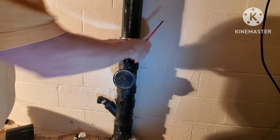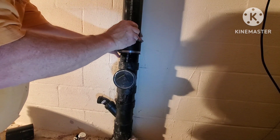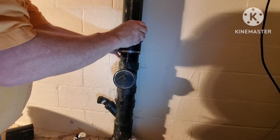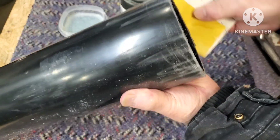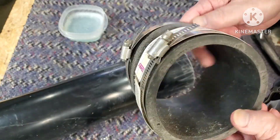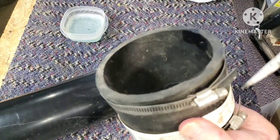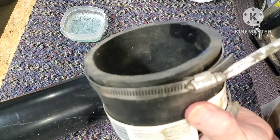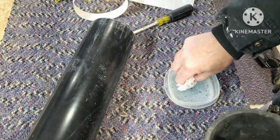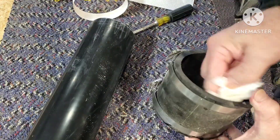That four-inch rubber boot goes there — I thought I was recording the whole time and obviously I wasn't, so I kind of missed that part. But after you get it in, just make sure you tighten it up real good. Make sure all the burrs and stuff are off both sides of that pipe. With your four-inch boot, make sure you loosen those strap clamps all the way — loosen them up real good so you've got plenty of room to squeeze this thing on. It's going to fight you the whole way. Use soapy water and lube this thing up real good all over, heavy on the soap, on both sides of your pipe.